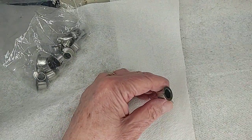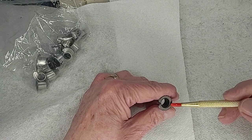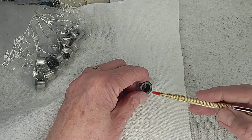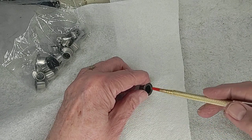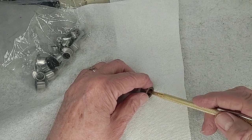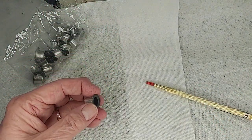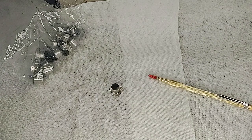As you can see here, you have a steel outer shell, and then this lining is PTFE. This is what goes first — everything is good when you first get into one of these, and then over time crud gets in here, wears out the plastic, then you're steel on steel, and then things start to rust, and then the steel rusts through, and you're left with trash. The inner diameter is 10 millimeter, and the outer diameter — I believe it's 12 millimeters, but let's check.